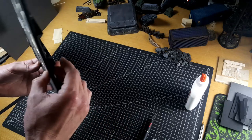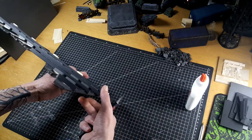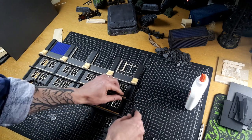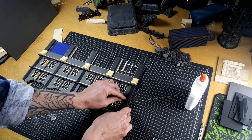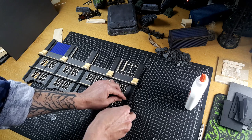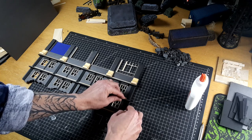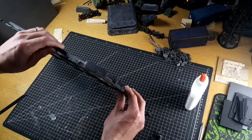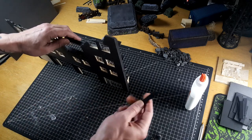Like I said, the sidewall will be inset slightly and not joined to that 45, so there is a good reason for this. Now, nothing in this build is really strict. You can certainly go about it any way you like. If you can't get 45s for the corners of your building, you could certainly just have them as butt joints and push them up against each other, and it will still work fine. But what I'm going to do here is just cut that down. As you can see there, I've just got a 45 angle there, and I've just eyeballed that.